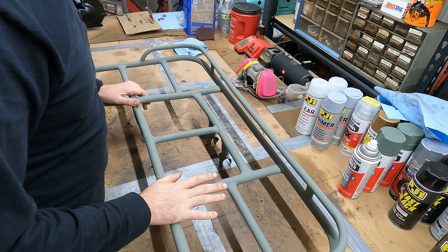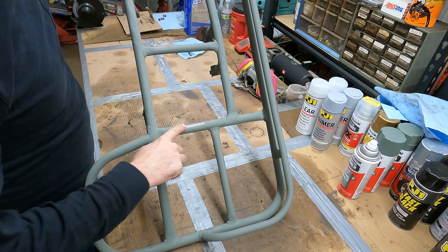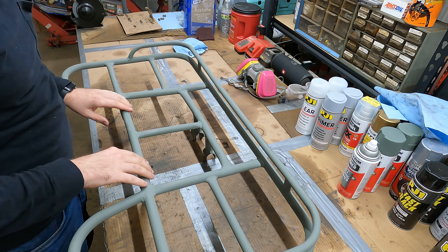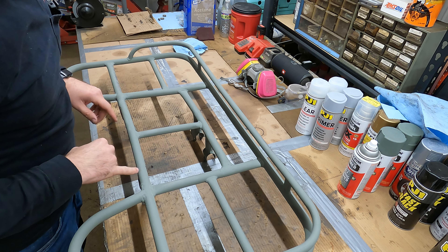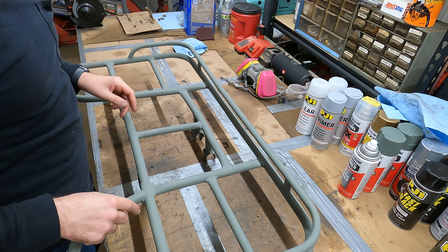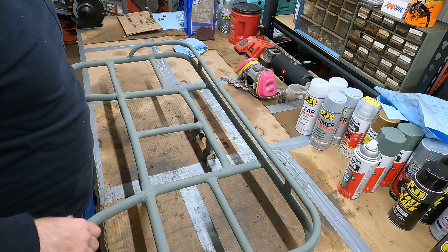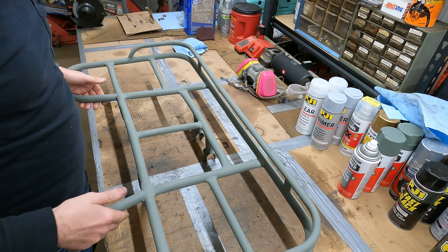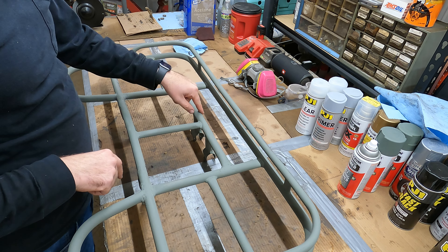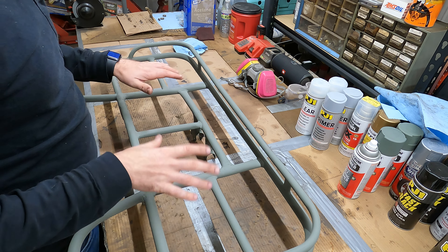I got one coat of primer on this already and I've let it fully dry. Now that I took it down from hanging, I realized I missed spots with the primer — now that everything's kind of all the same color, I can see the blemishes a lot better. I'm not going to worry about all the little pock marks. The one easy thing I want to get off is all the slag off of these tubes — all the little balls that stuck to it from welding because I'm using not the greatest wire. I'm going to get those knocked off, re-hang it, scuff all this primer up and wipe it down, and then put another coat of primer on.